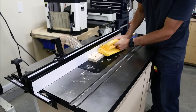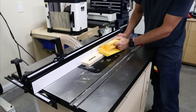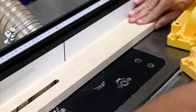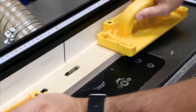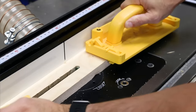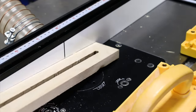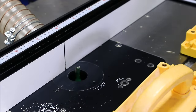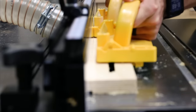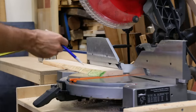I made the shallow pass on the bolt head on the new piece just like before. Then I went with the 3/8 inch bit to cut a slot starting an inch and a half from the end and going all the way to 1 inch left of center. For the second slot I dropped in the cut 1 inch right of center, so this gave me a 2 inch brace in the middle which completely shored up the fence and made it nice and solid. I finished off by routing a small recess on the underside of the fence that will be in contact with the work pieces, making sure no sawdust would get caught between the fence and the work piece to throw off the cuts.